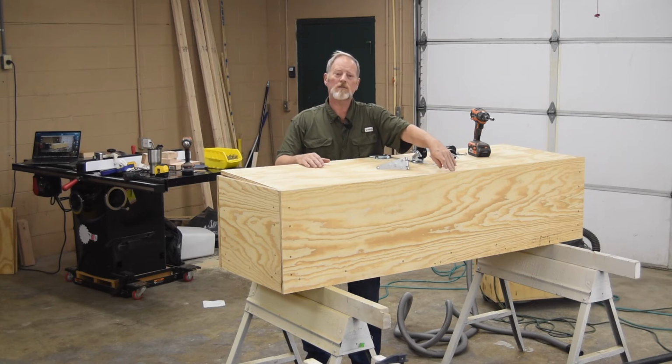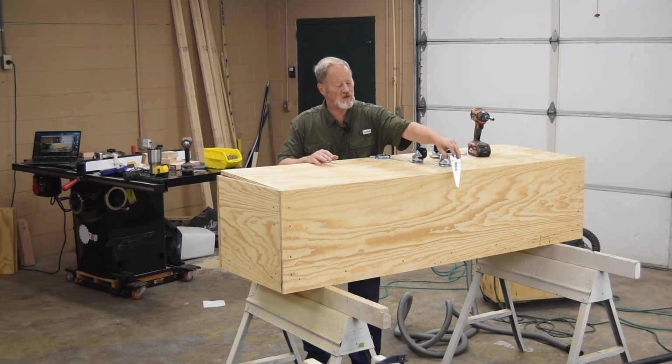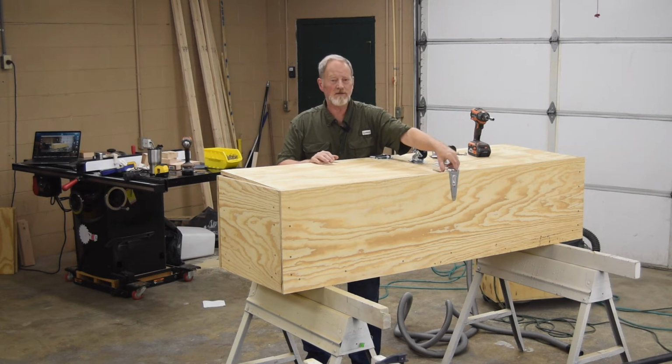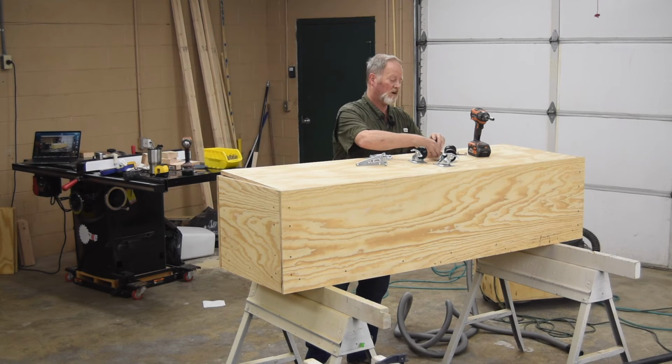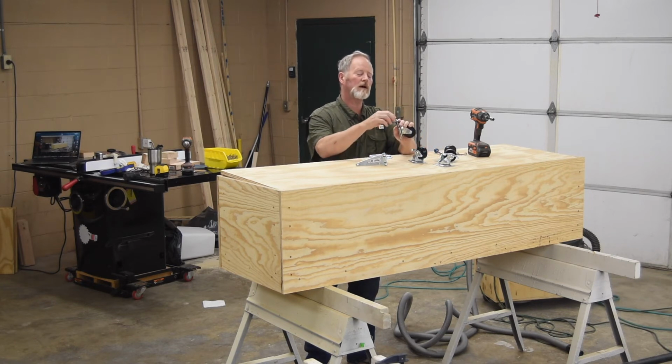We do not have one back here, and that's because we'll have a hinge here, and the hinge will do that job. Now, as you can see the barrel right here, we have to put a mortise in to get that to fit. But first, we're going to be putting in our wheels. And for our wheels, we're going to be using 1/4 inch hardware, and I will have a washer and a nut and another washer here that's not shown, but I'll have this little hex nut here.